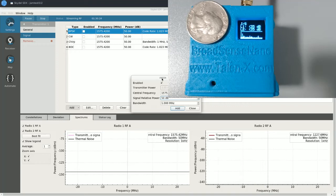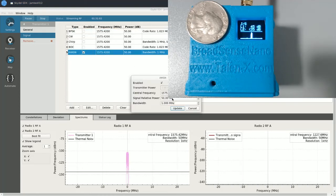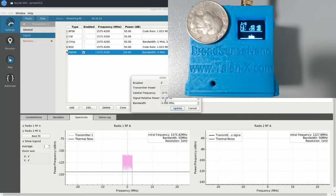Now I'm going to generate AWGN one megahertz wide. You can see we underestimate the J to S just a little bit for AWGN. You can see the shape in the middle — it's not as strong as the chirp but it's definitely one megahertz wide, and it's not a BPSK shape so it does kind of look like AWGN. Let's try increasing the bandwidth to four megahertz — and you can see the shape is now flatter and wider.